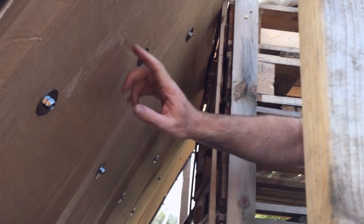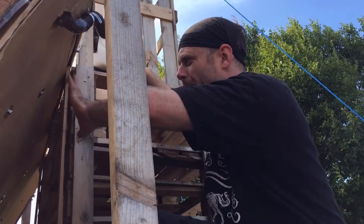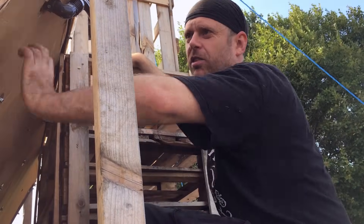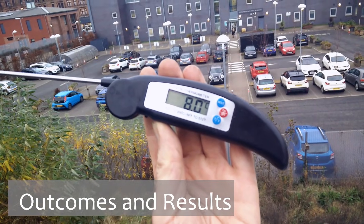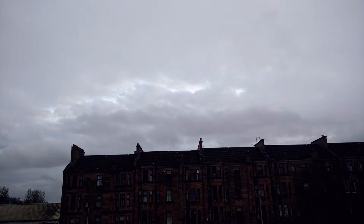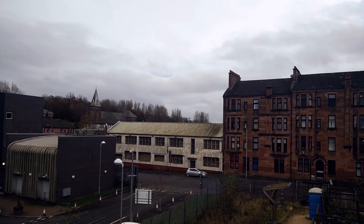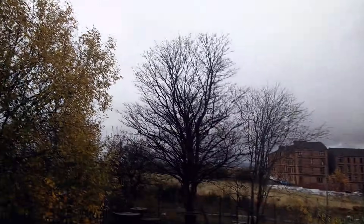So this is the insulation on the back. You can use anything here — polyethylene foam wrap, polystyrene, or something significant. I find just two layers of thin cardboard that we have lying around works fine. The air temperature is 8 degrees and the water temperature is 17.5. But this is with basically no sunshine — this is a Scottish November day and it hasn't had any sun for a couple of days. This would probably represent about a worst case scenario.